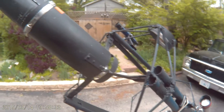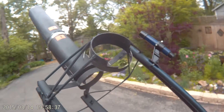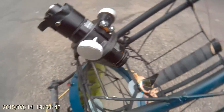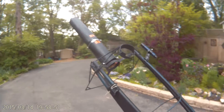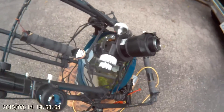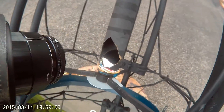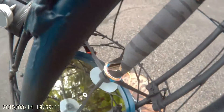This spider is removable, and I could put in my Newtonian spider and then put in the focuser in this spot here. You can see I have the same setup down here that's holding the focuser right now. So I can change it back and forth, but right now it's in the Gregorian setup where it's bouncing off the primary, this other mirror here, and then finally the angled mirror which is from the Orion tabletop telescope.